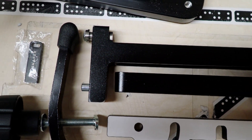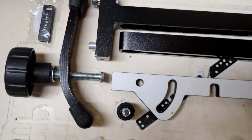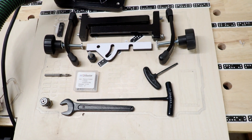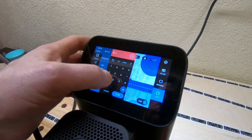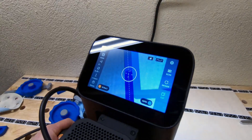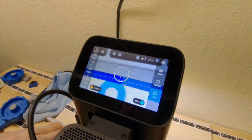Once my software problems were solved, I did a test cut on the 18x24 sheet of quarter inch ply that I used for a jig. I did shallow inside cuts of the parts and checked the layout with the actual parts. With the design more or less validated, I cut out the inside of the jig.